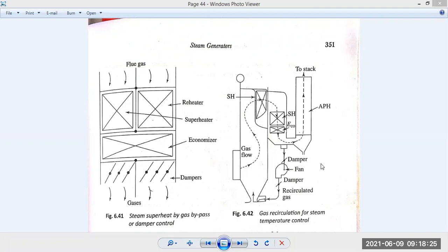There is another method: gas flow going from the furnace passes through the superheater and economizer, and comes out to the chimney or stack. A damper or fan is provided, and the damper can recycle gas — a portion goes ahead to the stack and if the damper is restricted or open, a portion comes back to the gas flow. When totally restricted, steam transfers maximum heat to the economizer and superheater. If the damper passage is open, a portion of gas comes back, so full heat is not transferred to the superheater or economizer.